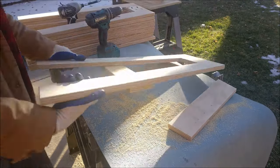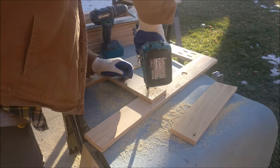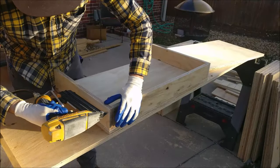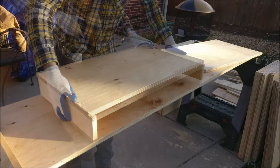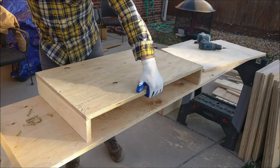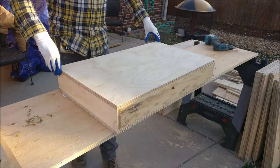Come in three quarters from the back so that your back cleat can attach to those later. Countersink and put four screws in. Cross-cut the top and bottom of the box at 30 inches, and nail and screw it to the sides. The sides are three and a half by 18 inches, the back is three and a half by 28 and a half and goes in between the sides. For the top, I just glued and nailed it.